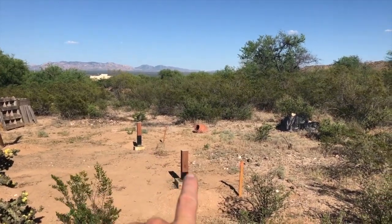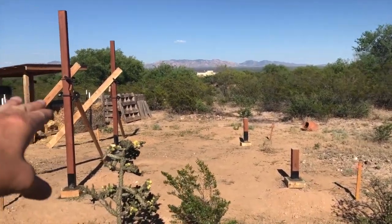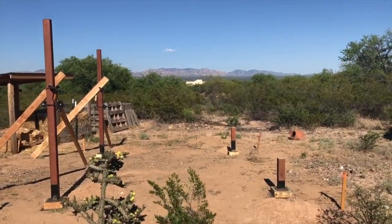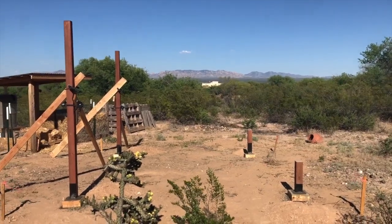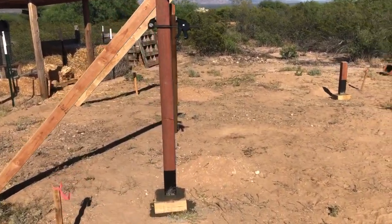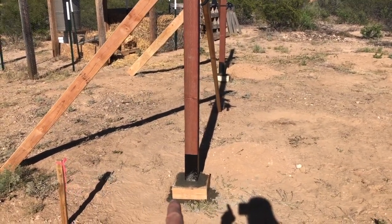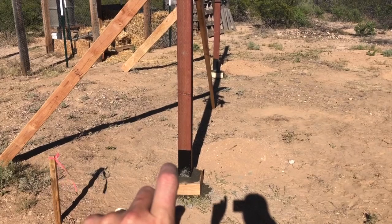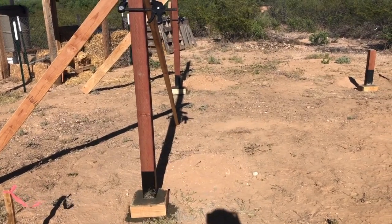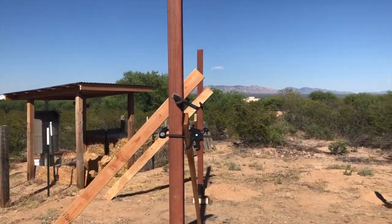The work we had to do was to make sure these were level, so we put a board across there and leveled it. The back posts I don't really care about — when I lay my rafters at the 27-degree angle that I want, I'll just chop those where they need to be. We also put a little collar around the base of the posts to build up a little extra concrete there and slope it away from the post. We painted the bottom of the posts with asphalt emulsion for a little extra protection from weather and insects.